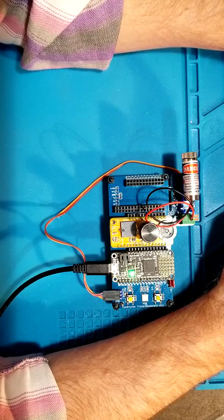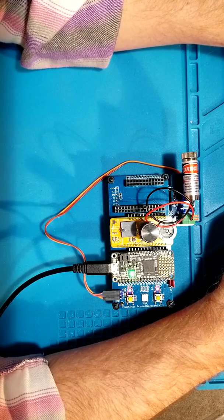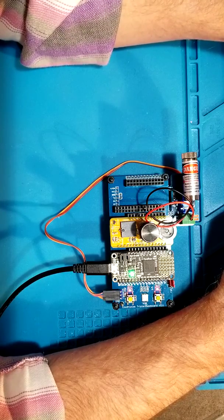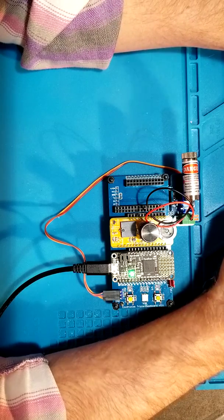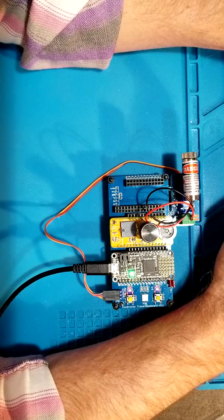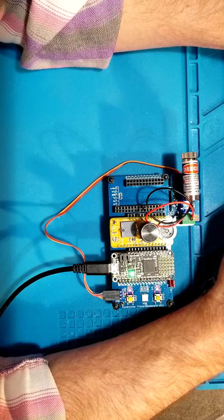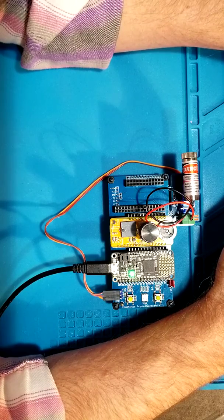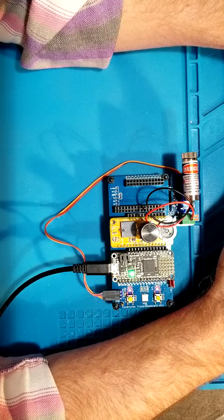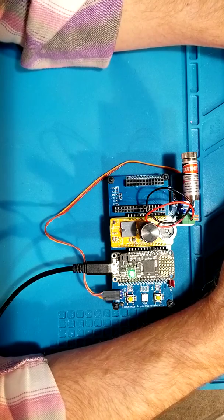When a board is plugged in, when it's powered up, whether it's in this kit or in a breadboard or not connected to anything else, the Feather board runs the Python code that's in code.py. All these other files that are in the Feather volume are helper files that code.py uses. So code.py is the name of the code that gets run by the board.